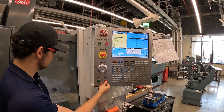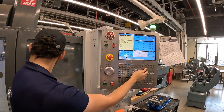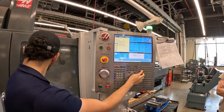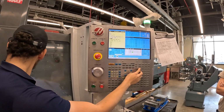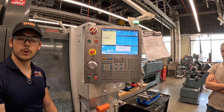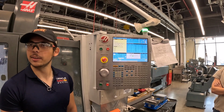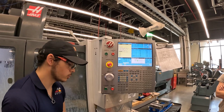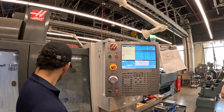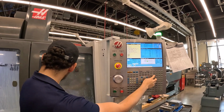And you might hear it. It's a very, very light cut. It is currently cutting. However, it was programmed with a very, very small pass. Yeah, we could probably go a little deeper than that. Okay. All right, this is barely shaking. You can actually feel the vibrations when it's cutting on the machine. And so I can definitely bring my feed rate back up to 100. You can see it's cutting out that pocket.